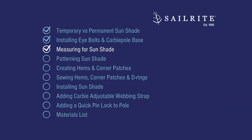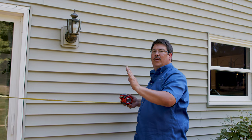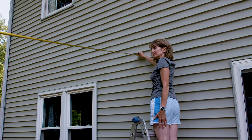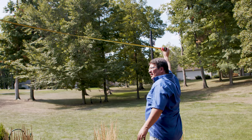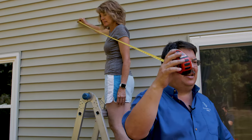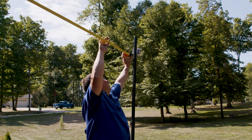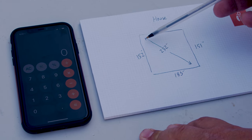Now that the hardware's installed, it's time to measure for the sunshade. We want to measure the four outside edges and then measure diagonally from both corners through the center. Our first measurement against the house is 159 inches from eye bolt to eye bolt. From the structure to the top of this pole is 152 inches, and then across from that one to this is 151 inches. I have a second helper, and she's going to measure from the attachment point on this end, and I'm going to run it diagonally to the top of the carby pole at the highest mounting position. We get 232 inches diagonally. We have our measurements from mounting position to mounting position and we have the diagonal.